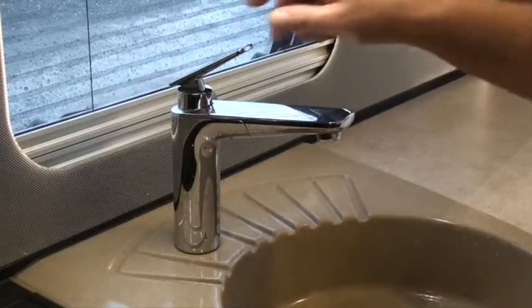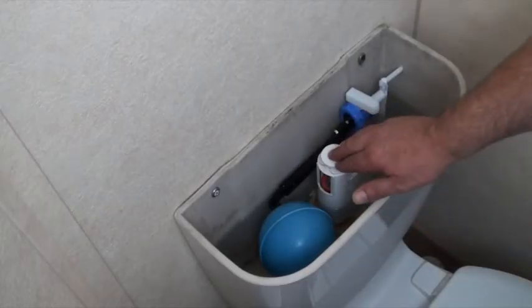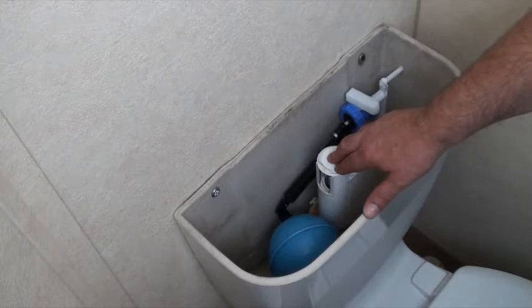This brings up an important point: how do you leave your water system over the winter months? Throughout the drain down, we've been turning taps on and off, and at this point all those taps will be in the off position. If you're leaving the property over a cold spell, it's important to open the dump valves and turn all of those taps back on before you leave so that the pipes have a chance to breathe. Incidentally, oxygen in the air circulating through the pipes is also a great steriliser. Now that everything is drained, in the case of a boat with a domestic toilet, it's time to flush it.